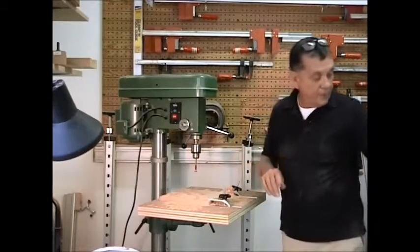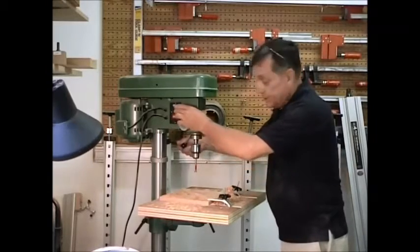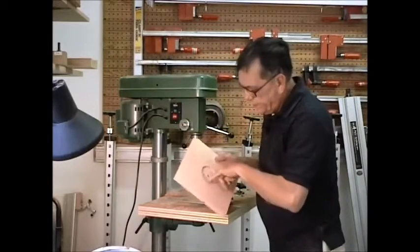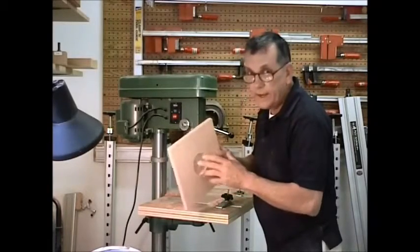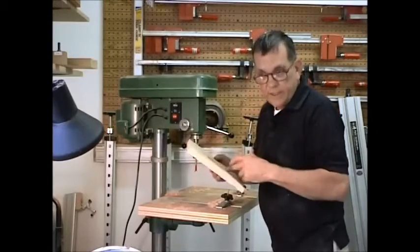We'll be able to drill the half inch hole all the way through — it'll definitely be centered right on that piece where we started. Now we have our half inch hole drilled right through the center. Here's our larger diameter hole which will be our drill guide when we go to finish drilling it out. We're now ready to go back to the Ringmaster and cut whatever size we want.